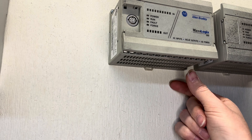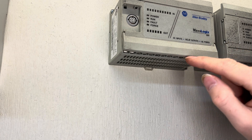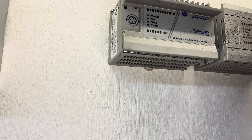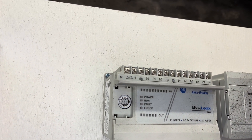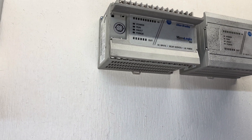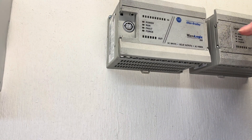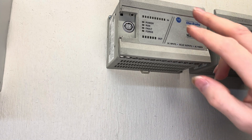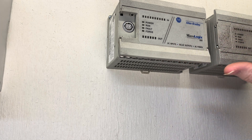You'll get some of these bricks that are a lot skinnier — about half the depth. Those are going to be your DC power modules; they'll usually take a 24 volt DC power input. Because this one does have a built-in power supply on board, up top here on the very far left you have a 24 volt DC output that can be used from the controller itself. It's generally a very low current — probably 0.6 amps at 24 volts DC. You don't have any regulation or control over that, but it does have the ability to send some DC output so you can use it for your DC inputs, such as simple IO.